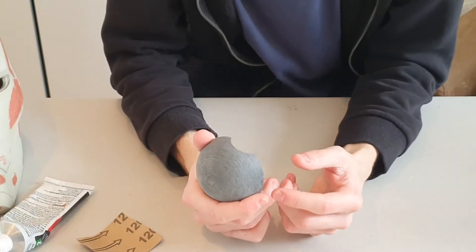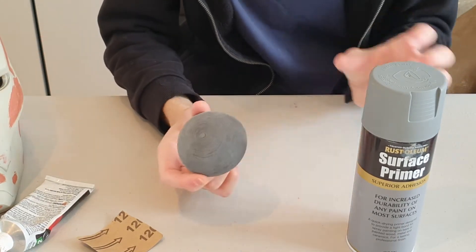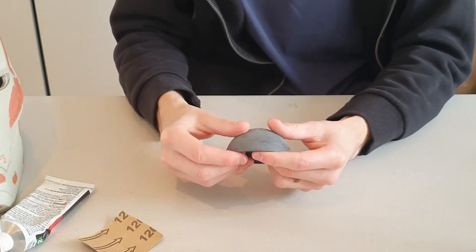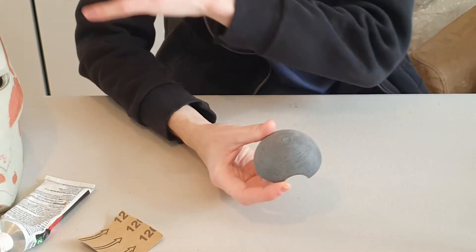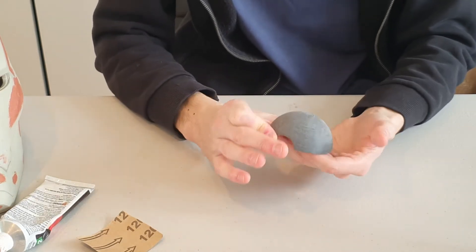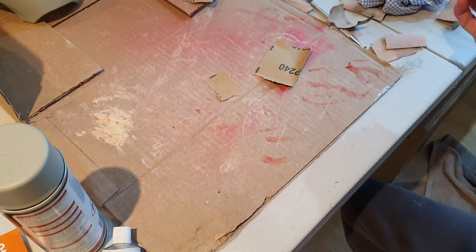As you can see there are still a few little bits that are too deep to sand without taking out some of the shape, so I leave them and they'll be filled with some spray putty. I'm going to take you outside and spray putty this - it takes about 20 minutes to dry. On small parts like this I sometimes don't use the surface primer straight away. I typically do on big prints because it helps me see where I haven't sanded enough, but on something small I can feel most of it with my thumb, so I'm going to jump straight to the spray putty.